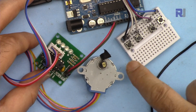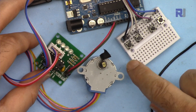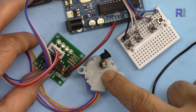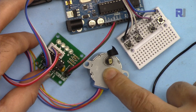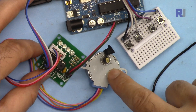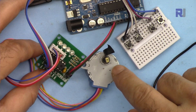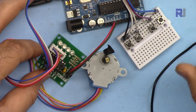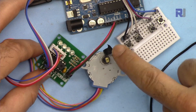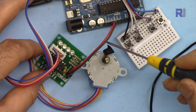We have two types of stop: one is just stop, and the other is hold. Because this motor has gears it will hold position anyway, but I made that option available — in some applications you need to hold something in a certain position, consuming energy to maintain it. That option is available. This push button goes 270 degrees.